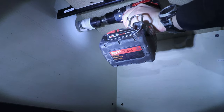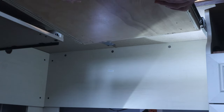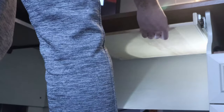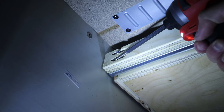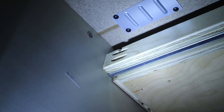Here I'm adding a hole at the back of the desk to allow cords to pass through, being careful not to let the bit punch through and ruin the wall. I use my combination square to ensure that the drawer slide here is the same distance from the desktop as on the piece of 3/4-inch plywood. To keep the cords from hanging down, I'm adding a screw-in wire ring.